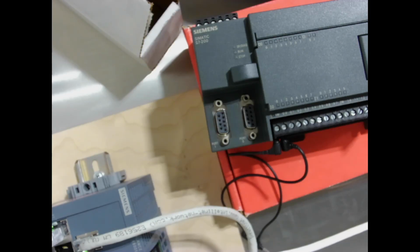So really depending on the environment that you're in is when you're going to pick which type of wiring system. Most of them are going to be your standard twisted pair RS-485 is what it comes down to. Now, the nice thing here, up to 24 kilometers is what you can send Profibus.